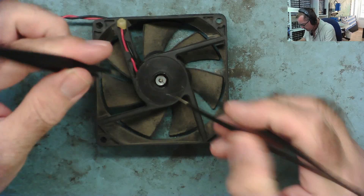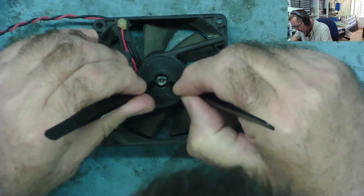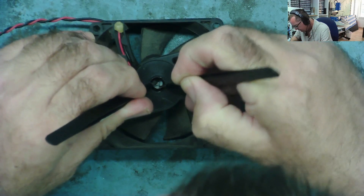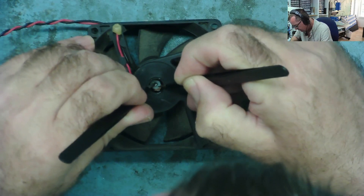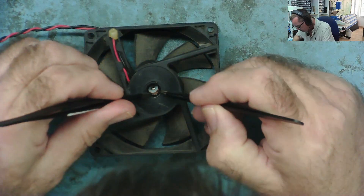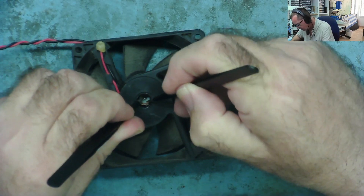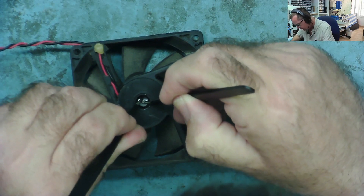Here's the little clip — I've sorted it in place on top of the shaft. I'm going to try and use two pairs of tweezers to walk it back into the little ring that holds the shaft in place. Just by pushing down on both sides, this will clip back into place. It's a little bit tricky but with a bit of patience you can get it — just allow the split to open up slightly. I think we have it.